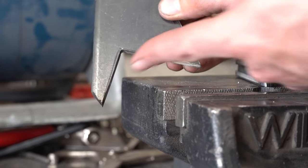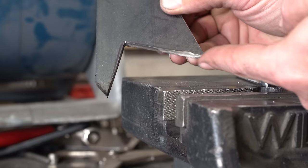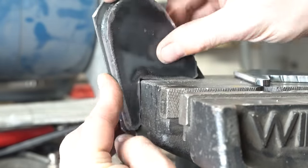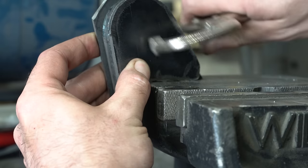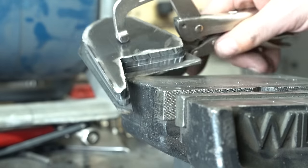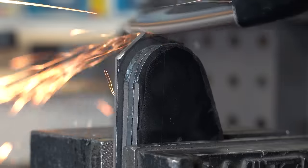After cutting all your parts, stack them together, taking extra care to line up the edges that contact the crossmember. All the other edges may or may not match up, kind of like the one we cut with the grinder, but we'll fix this in the next step. Clamp your stack tightly together with some locking clamps or a vise and start smoothing out the edges.